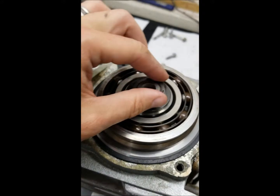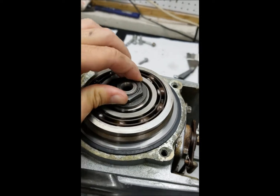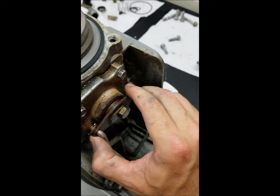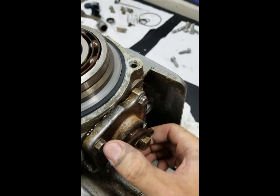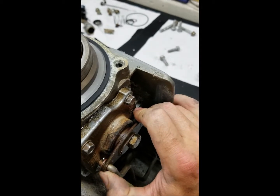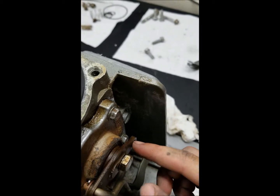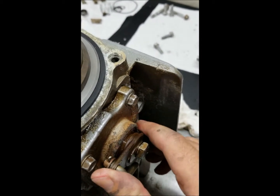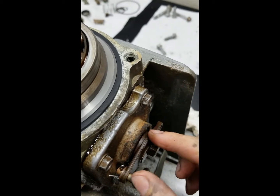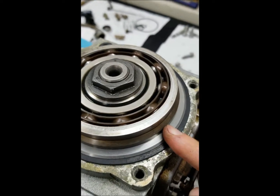The way I did it: put my socket on here and turn it back the way it would go. One thing you need to do on this shifter — you can see how as you turn it, it goes in and out because of the detents. There's a special fixture that bolts up to these bolts and has a through hole to hook up here, but really you don't need that. You just need to turn this until you're at the position where it's pushed in the most — that's where you want to be because that's pushing the shoe as far as it can into the clutch.